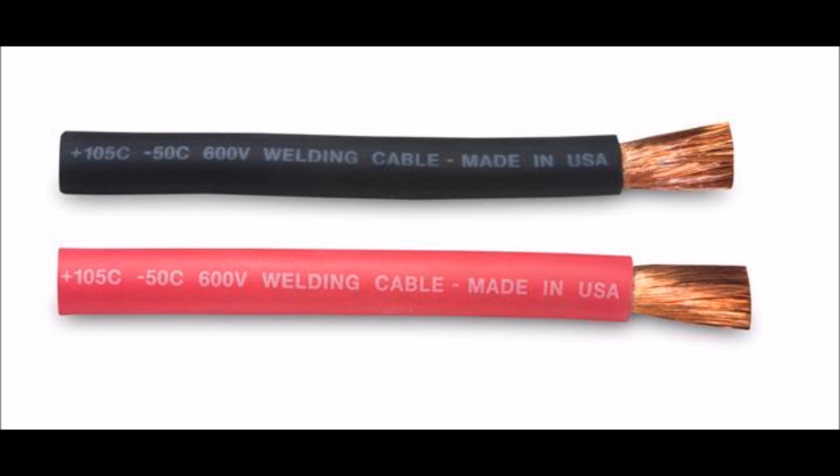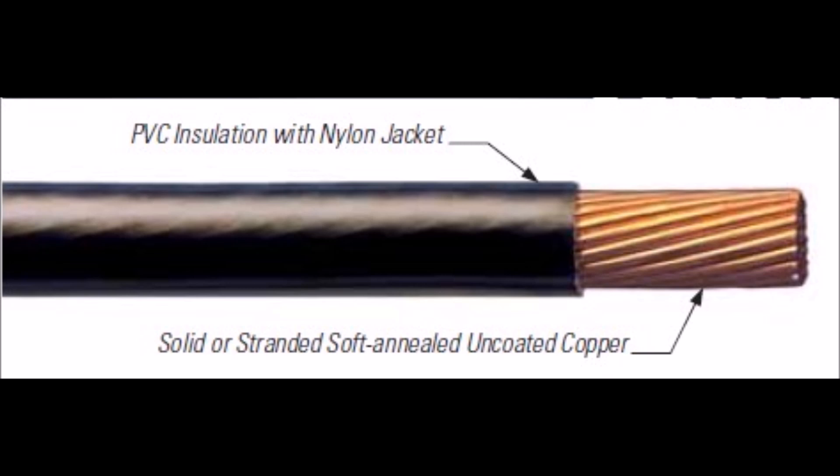That's my personal favorite for battery connections. For everything else, my personal favorite is THHN wire, which is a designation used for outdoor purposes. The jacket material is resistant against UV for sunlight and it's weather resistant, so that's what I recommend you use to connect your solar panels to your charge controller — anything that's basically going to go outside.